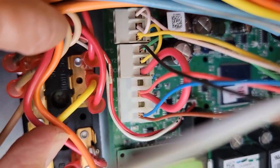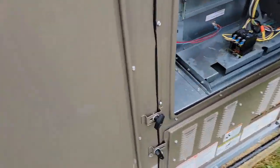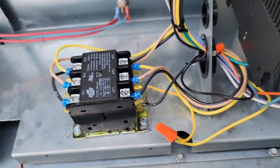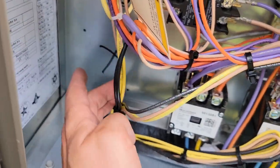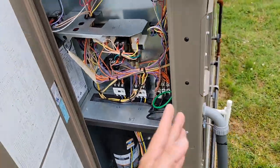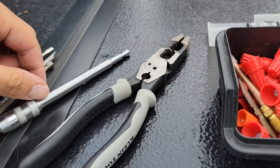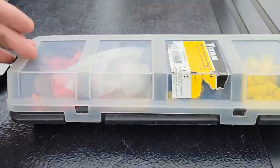There are our thermostat connections — you can see G right there, that's where we put the black wire in, and down to C, that's where we put the brown wire in. So now we've got two wires to energize our coil. We ran the wires over and connected G and C. It would be better to mount the contactor inside the unit — closer to the low-voltage wiring and out of the airstream. Tools used: wire strippers, a thermostat screwdriver, drill bits, flathead, Phillips, and some wire nuts.